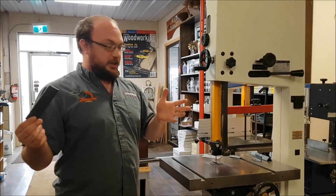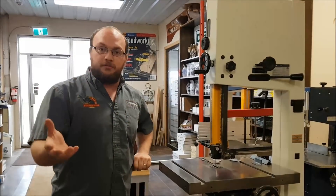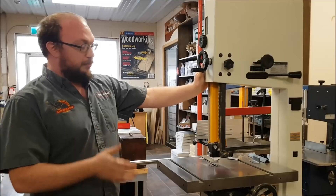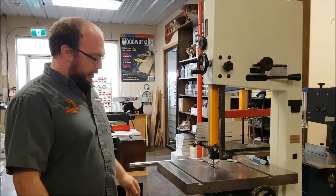The internet is going to tell you no, because for metal cutting a bandsaw you're going to want to run between 85 and 250 linear feet per minute, and this bandsaw is going to run about 1450 or around 2900 linear feet per minute.